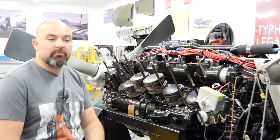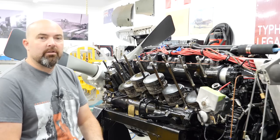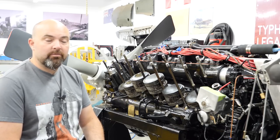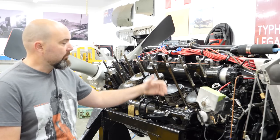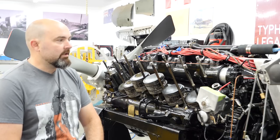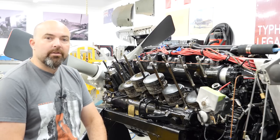And we knew these drain tubes were there. I personally assumed that they were actually cast into the blocks during manufacture, but they're not. It's a brass drain tube of approximately 3/4 inch in diameter, and it runs down through the block, but it passes through the cooling jacket. So we're still investigating what was going on, and until Rob was back at the shop the next time, I continued to play with it a little bit.